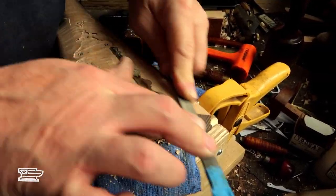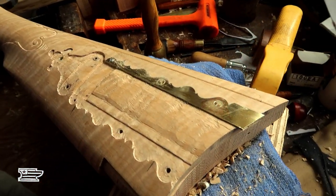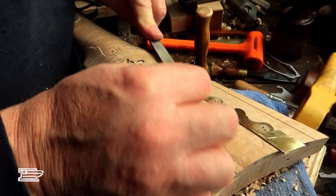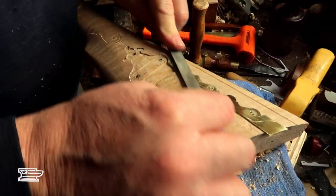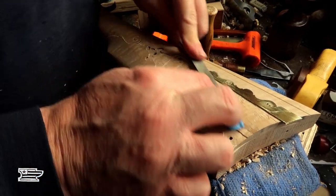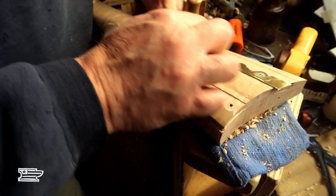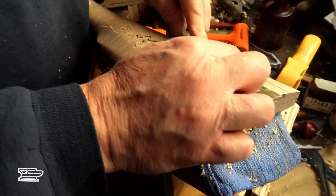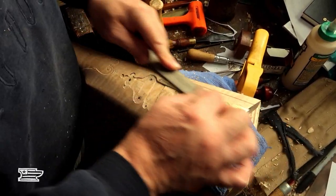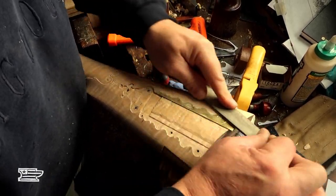This filing is getting a final fit — getting this brass down to the wood so everything matches up perfect. Once everything matches up, these can be cleaned up, engraved, and dropped back on — then the gun's done and good to go. Like everything else, you just don't want to go crazy on something and go after it too much. Be gentle and work things down.